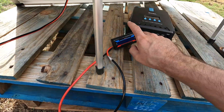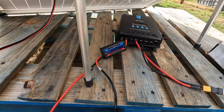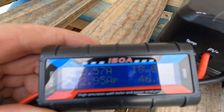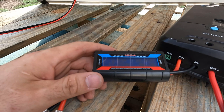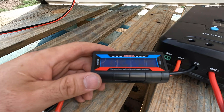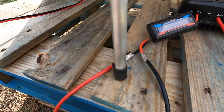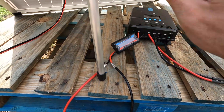I want to use this in a later video — when we have a really sunny day we'll test each panel and compare and contrast which one's pushing how much power. It's a janky way to do it but it does work. The power meter also shows minimum and maximum wattage seen so far and how many amp hours it's pushed. Eventually I'll make nicer leads, put some heat shrink on, build a proper test stand, and we'll have a real way to dyno our solar panels.